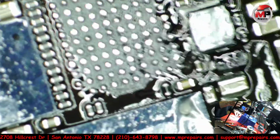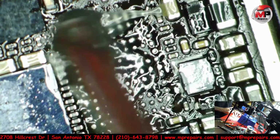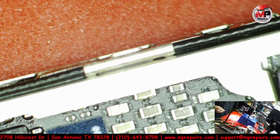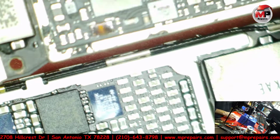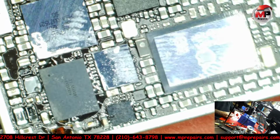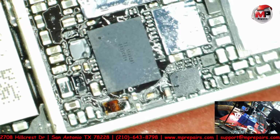Alright, so zoom back out real quick. Put a little bit of flux. This thing likes to squirt a lot at once. Alright, so which way we put this motherboard this way, and what way we said the IC chip went. That's not the one. That's the one. So the dot points to the top. All right, so we are gonna place this there.